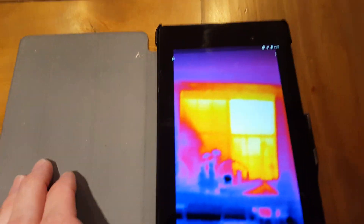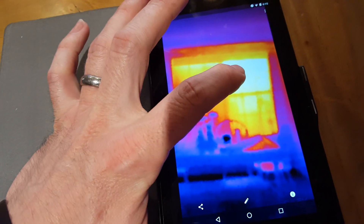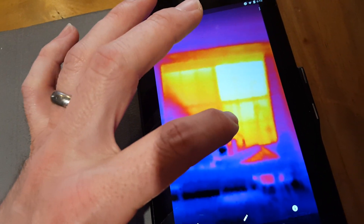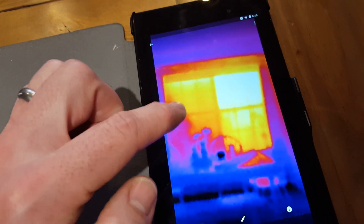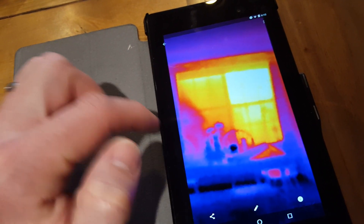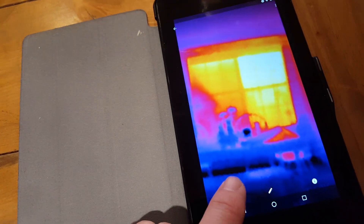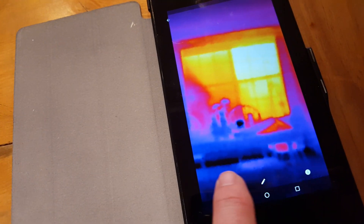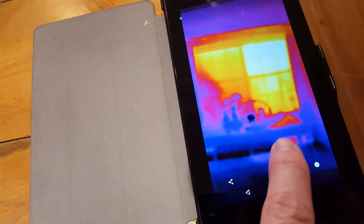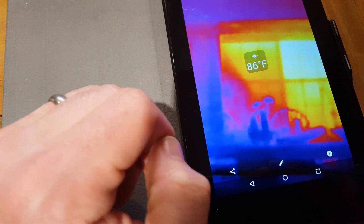I was more concerned about heat as opposed to tinting. I have a thermal imager here. In the thermal image, brighter means more heat and cooler colors mean less heat. On the side with the window film you can see it's definitely different colors. Here's my porch, the shadow from the porch, and the interior — you can see the coldest spots along the corners of the tile floor, and some heat leaking in from the window. The temperatures it read: 86 degrees on the left side with the heat control window film, and 99 degrees on the right side.